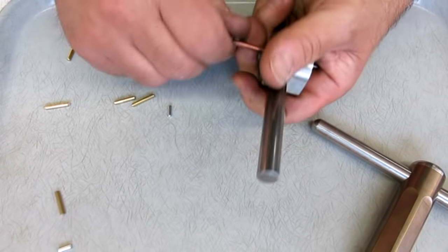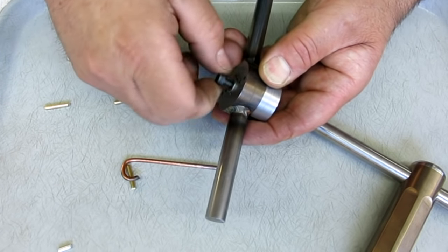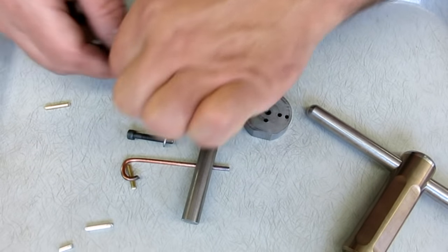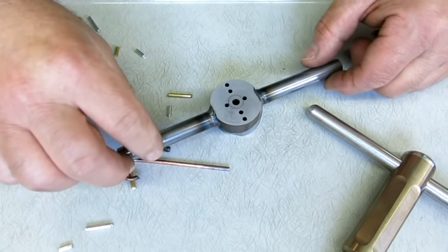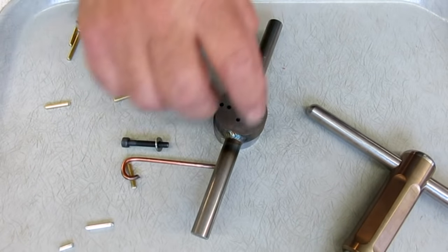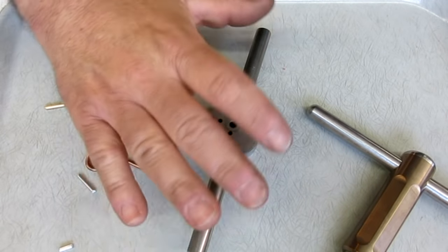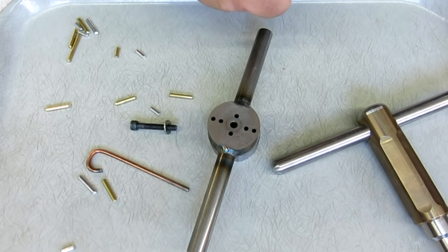All right, let's start with this thing here. What this is, let me just take it apart and show you. This was used to determine the right breakaway torque, okay? And the way this thing works internally is it has a couple of shear pins. As you try to rotate these in relation to one another, it shears a pin off, okay? Now, you can calculate these things mathematically from the yield strength and radius and those kinds of things. But what I was looking for was a very, very specific feel on the chuck wrench. When you tightened it up to a particular point, it was just going to let go, okay?